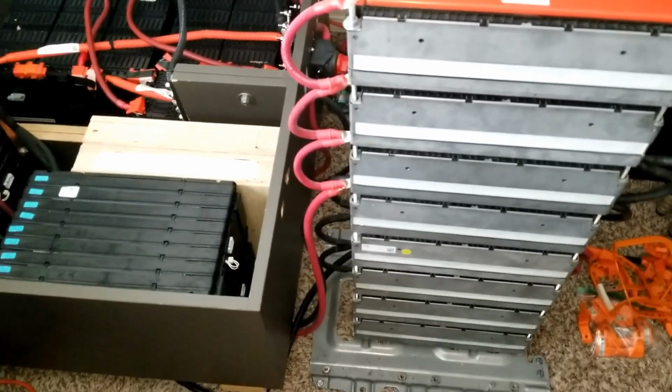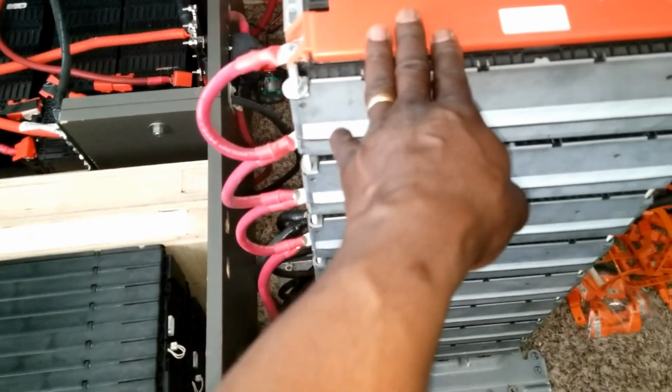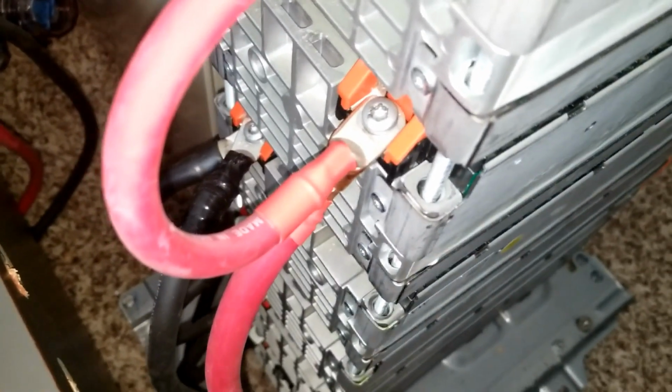But now already change over. And this pack here has been disengaged. So what I'm going to do, I'm going to take this one out. This bolt out and remove the positive wire because it's already isolated and remove the negative wire. I think I'll leave the negative wire. All I have to do, yes, I have to remove it because I have to bring the other side here of the negative to match with the other ones over there.